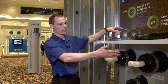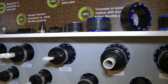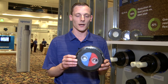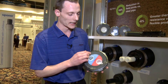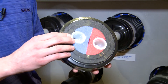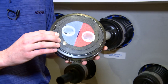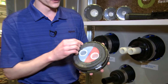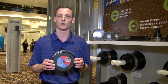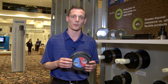As you can see here we have a bunch of different examples of what the product is. Here's what we call one of our donuts. Echoflex is a product that has an HDPE corrugated jacket with different levels of insulation all the way down to the service pipe. We make the product in twin and single configurations. One thing to note about the system is that all the layers of foam are independent of one another and they're not bonded to the pipe or the jacket. That's a key difference with our product versus some of the other products in the market.